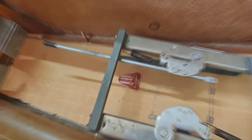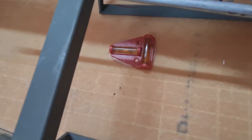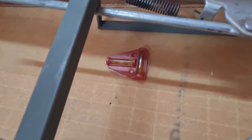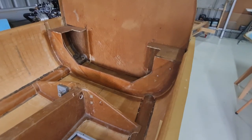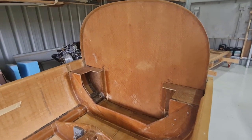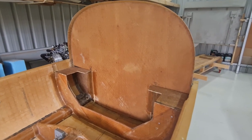What they suggested in the manual was putting a little level, just glue it to the bottom of the fuselage in about this position. So here I've got a little one off the caravan. So with the fuselage being level, now you can make all your bulkheads 90 degrees